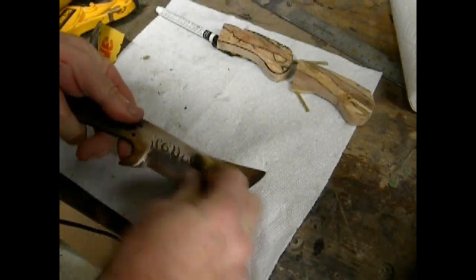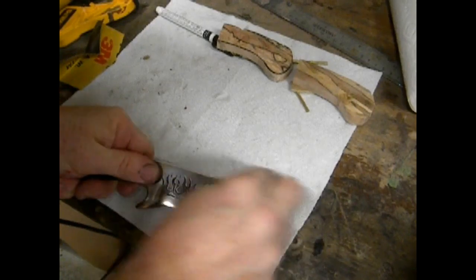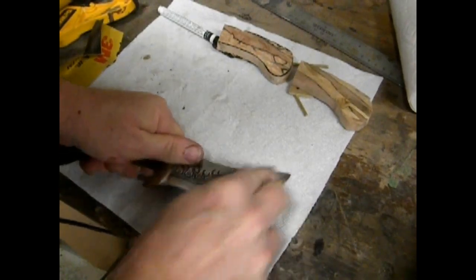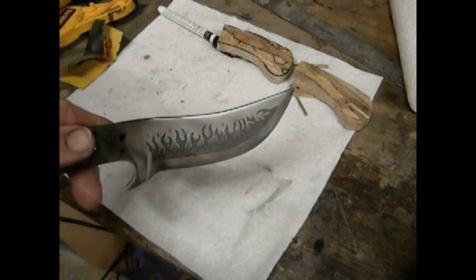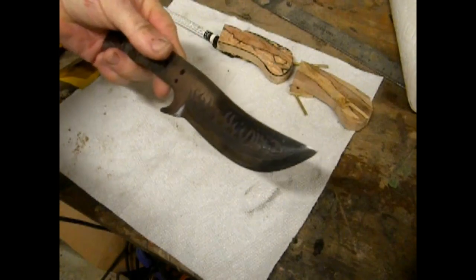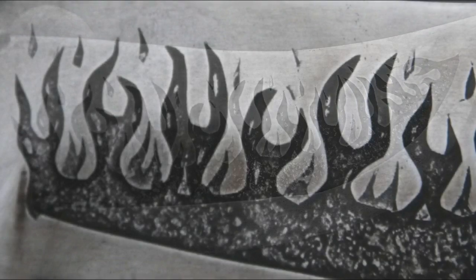I tempered the blade, and then I came back and polished off the tempering color with 1500-grit paper, which gives it its final polish and adds a little bit more detail into the flames — it removes some of the black from the center of the flames and gives it a really nice two-tone look. And that's the finished blade with flames etched onto it. Just repeat the exact same process on the opposite side. A closer look and you can see the two-tone flames, the background flames, and the embers. You can be as creative as you like depending on your artistic ability — the process remains the same.